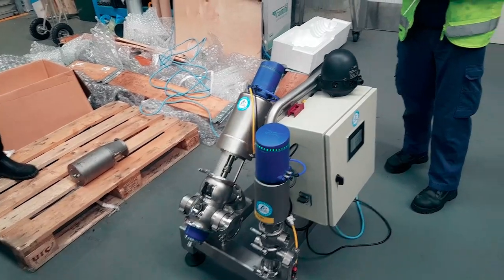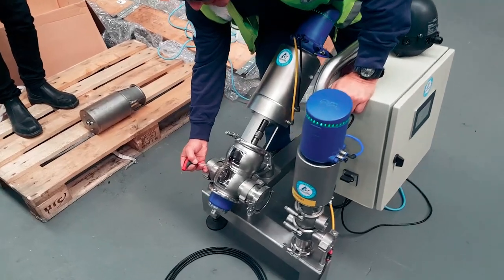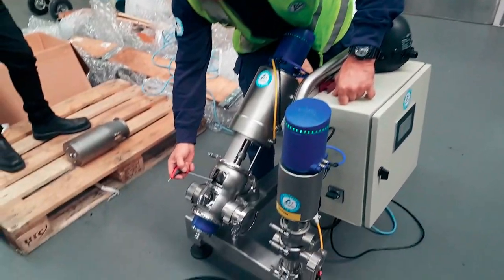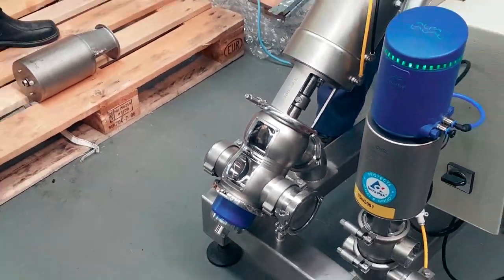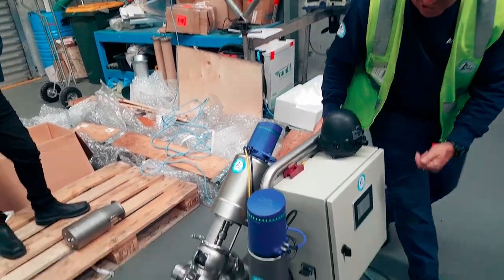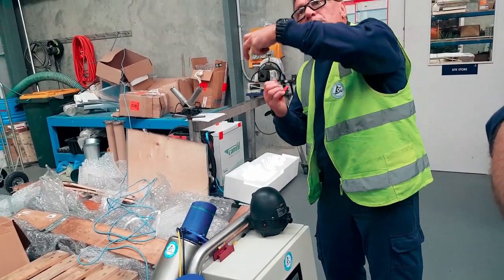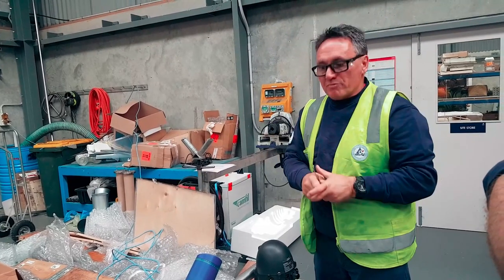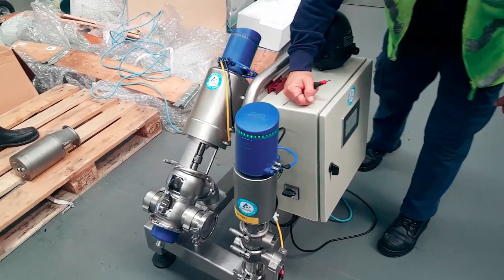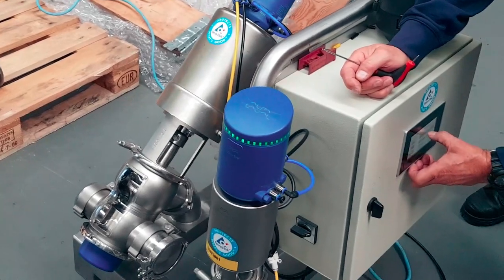First thing this morning I said to you, what's important to understand about this valve? This is your lower plug here, and it's a radial seal. So it seals on the outside. This is your upper plug and it's a lineal seal, and so it seals down in this axial movement. When you push it, the noise that you hear, the shh, dunk, shh, is exactly that plug coming up into the upper plug and then making the movement. And that's the product. You say to the operator, turn the valve on, please. Turn the valve off, please.